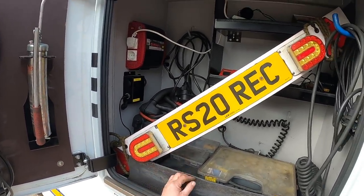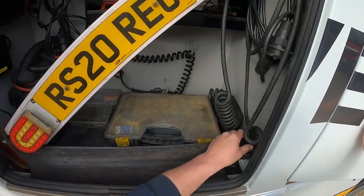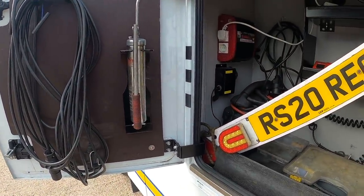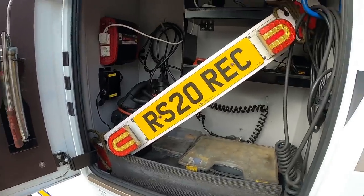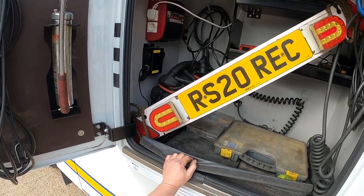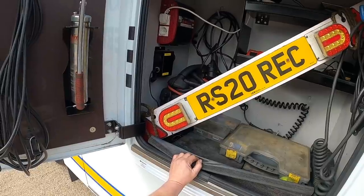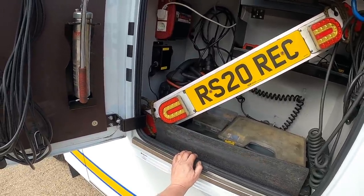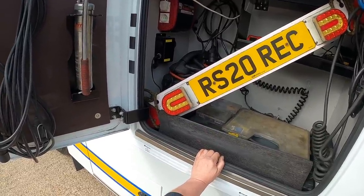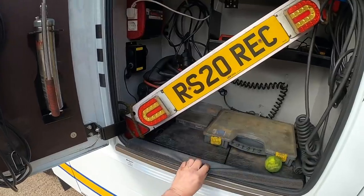There's a little charge station here where I charge the electric air guns. There's also a grease gun to regularly grease the boom main pivot point. We've got a battery pack here - a lot of buses and coaches now, you can't just put air into the suspension and have it come up. You physically have to have power in the battery, so you connect the battery charger, get some air into it, then you can get the suspension up. They are very low now, so that's very handy.